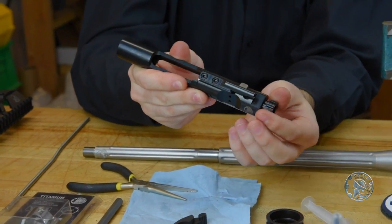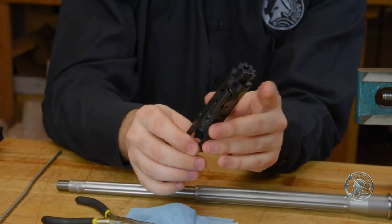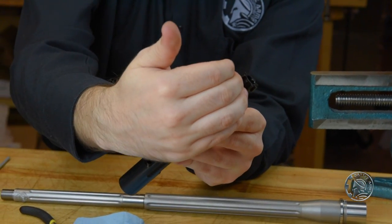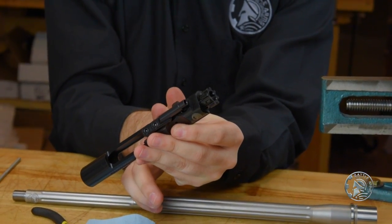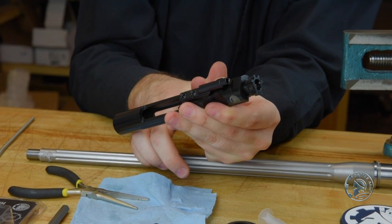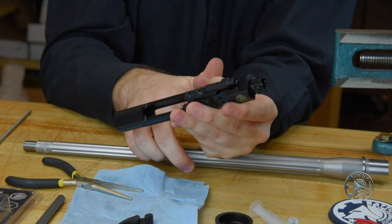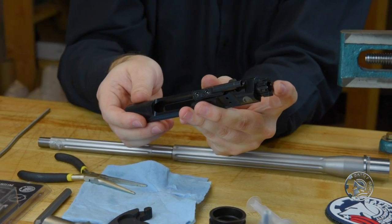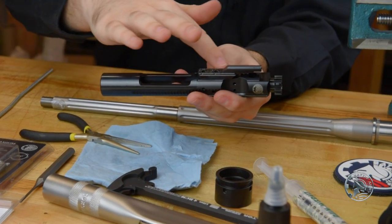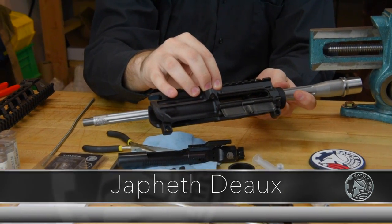Check the function of your bolt and make sure everything is where it should be. You can check the protrusion of the firing pin with the bolt in the locked position — that's with it all the way back — and then press against the firing pin to see if it pops through in the middle. If it doesn't, you may have issues with light strikes on your primer or misfires. That completes checking our headspace and reassembly of our bolt. Join us in the next video and I'll show you how to install your barrel on the upper receiver.